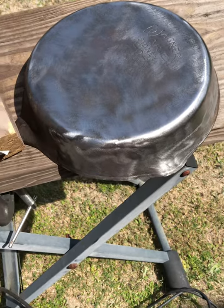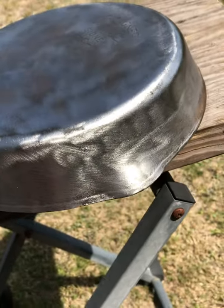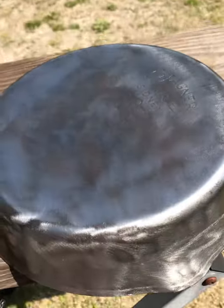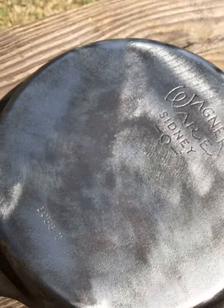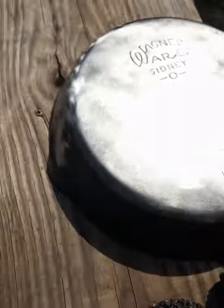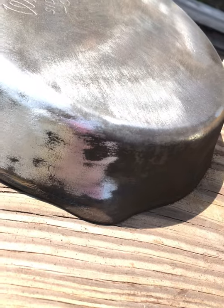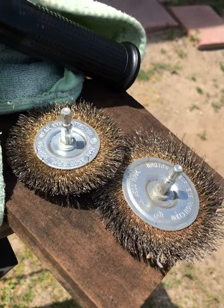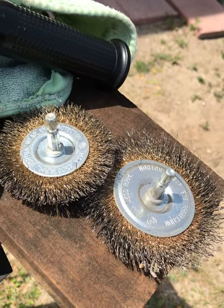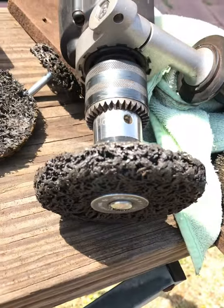A little update on the progress — we're getting around the edges and also on the back. This is really, really smooth and you can see that it's not actually black metal. I'm working on this side some more — I'm now using my composite pad because the wire wheels stopped being effective, so I've gone over to my paint/rust remover.